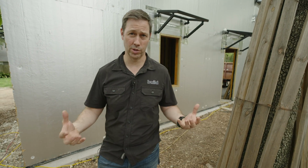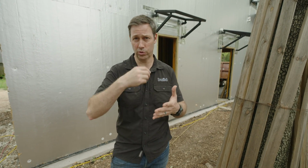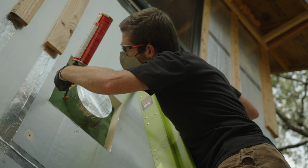But it's really important not to install your siding or whatever you're using on the outside of your house before those trades make it through your house. And in today's video, we're gonna address that critical juncture where those things penetrate the house, whether it's hose bibs, electrical outlets, or maybe ducts for bath fans or for kitchen exhaust. We need to make sure where those penetrate the building, in my case the ZIP System sheathing, that we're both watertight and airtight there.